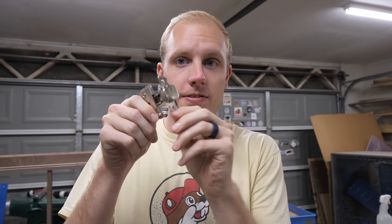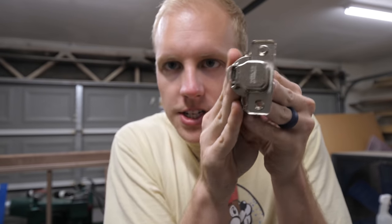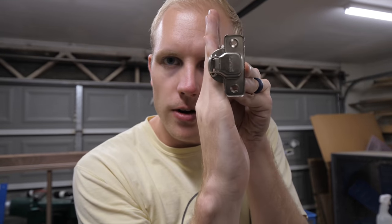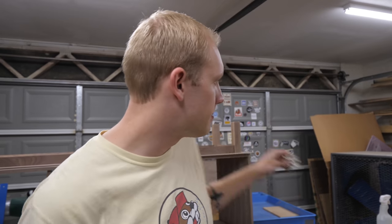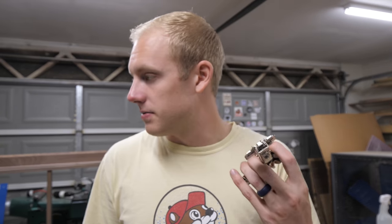All right, so we got yet another problem with these cabinets — my problem. I did not check if these were the right hinges. This part mounts up inside and then the cabinet door closes over the frame, but our doors are inset inside the frame, not over the top of it. So I have to go get new hinges — there's no way to make these work. I could make wider doors but I really don't feel like cutting up the last bit of plywood we have. So the faster thing — not the cheaper thing — is to just go get new hinges. Once again, a last-minute run to Home Depot. I try to not make a last-minute run to Home Depot — I don't think it's possible. Two hours later...